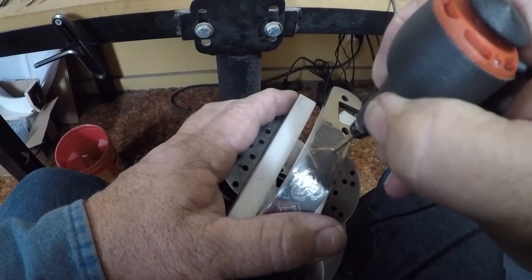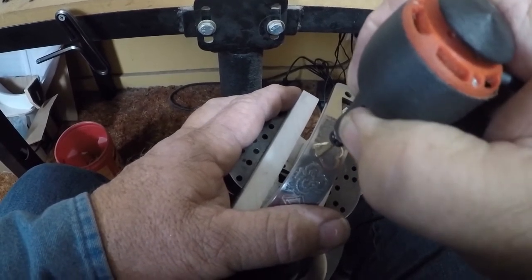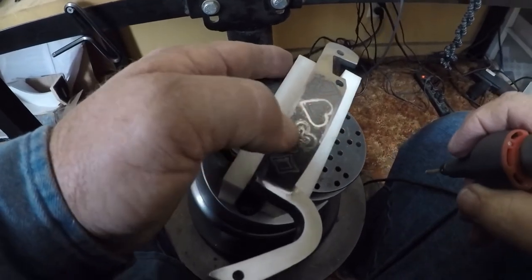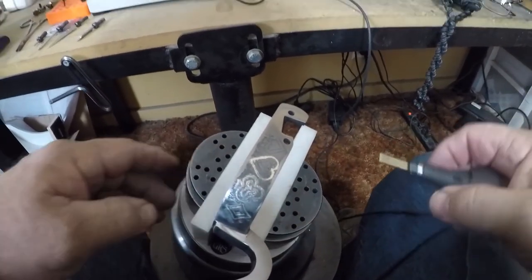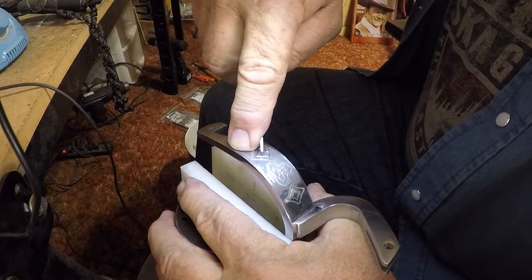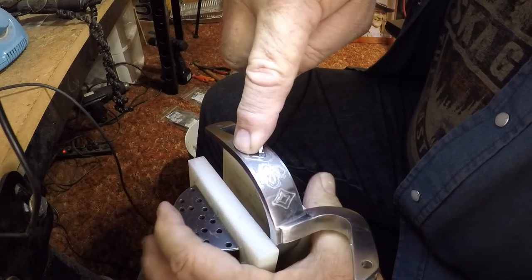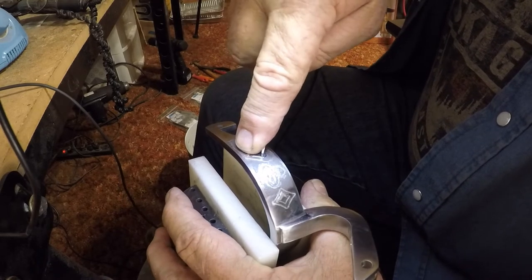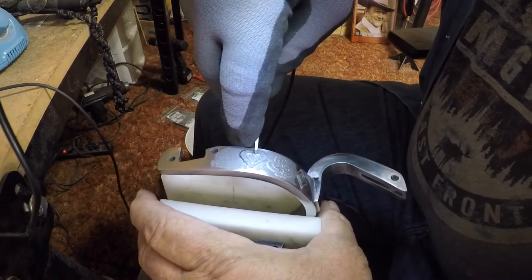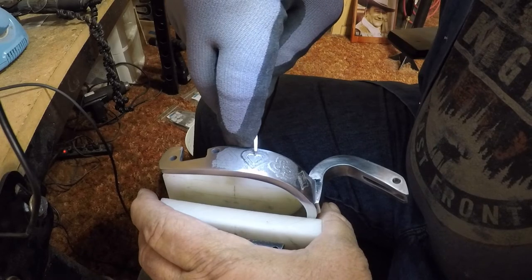Just keep working it there. This brass rod every once in a while has to be taken out and run on your hone or sharpener because it'll start curling over on the ends — just shape up the end and make it smooth again. Here I'm doing the inner part of the heart, showing how I use that number 40 flat graver with the special grind to put the undercuts or wedges into that channel — going around the outside edge and inside edge of the channel until I get those into place.